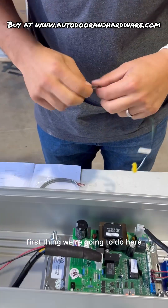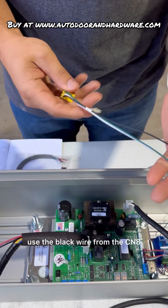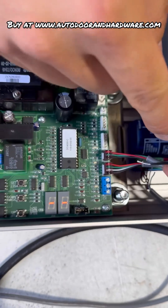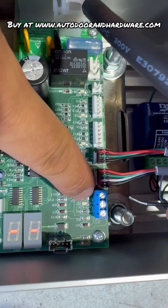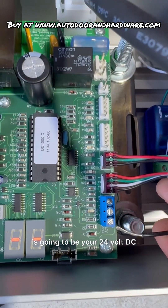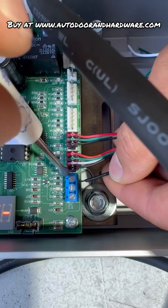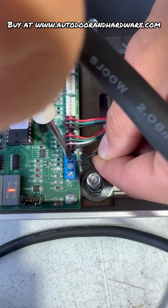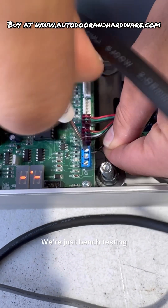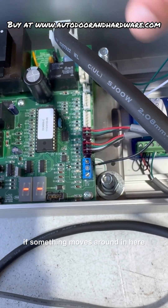The first thing we're going to do is use the black wire from CN8 and go to number one on the terminal block. Number one is labeled on this side — one, two, three. Number one is going to be your 24 volt DC, and this is going to energize the strike. I stripped these back a little too far, but we'll use them for bench testing. I'd recommend you don't strip wires back this far because they could potentially short if something moves around.